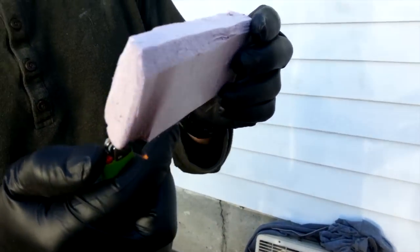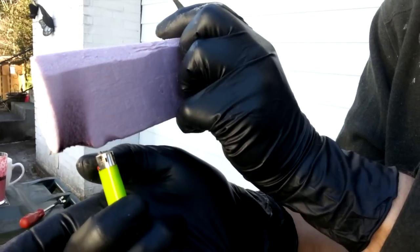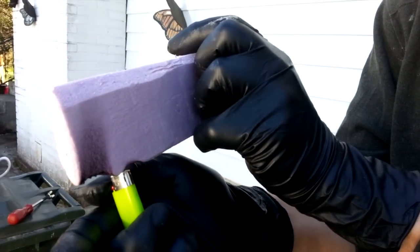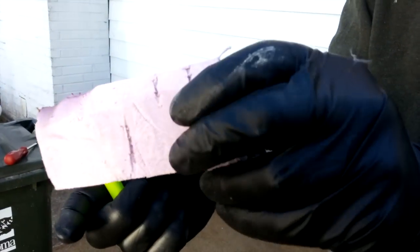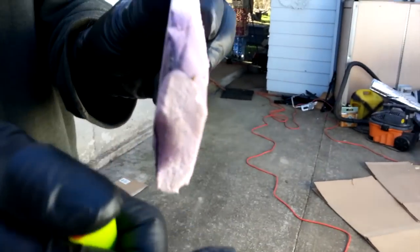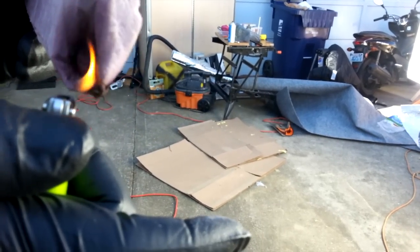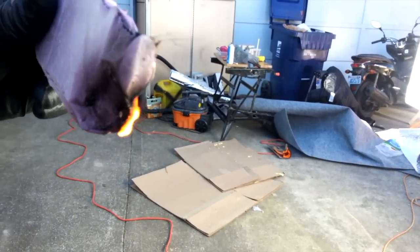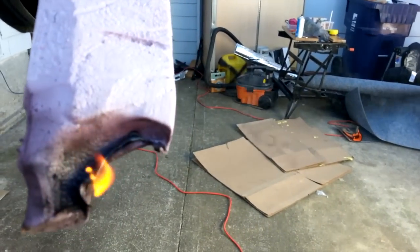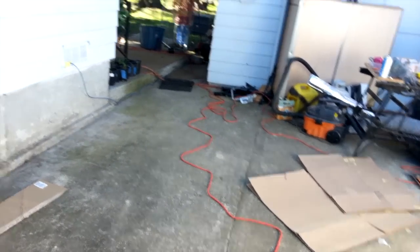So this is the pink board burn test — we'll have to see if anything's better. It feels like burning styrofoam. This is a petroleum-based product. It's not all pink and fluffy like it looks. When I'm using the multi-tool and cutting this stuff, it creates little tiny fibers that flow through the air — it's a pain to get rid of later. I probably shouldn't be breathing this stuff because it is a petroleum-based product. But it's melting more than anything — it just shrinks up. It's all hollow, all air. This seems to be more flammable than the Great Stuff. Probably very toxic fumes out of that.